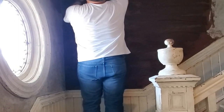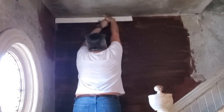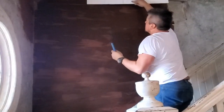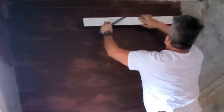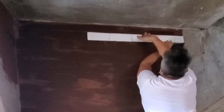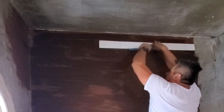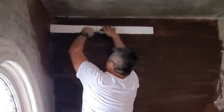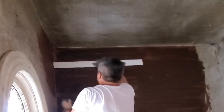You just want to add volume to the wall and make sure you have something to work with. By using that little piece of cardboard and scratching the surface with the piece of pipe, it's like scraping butter off a plate — that's how simple it is. I'm scraping it with the pipe, which pulls out the material leaving a little groove, simulating the depth of regular mortar.